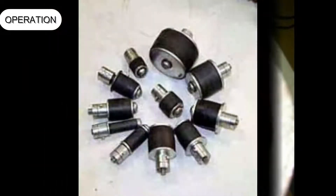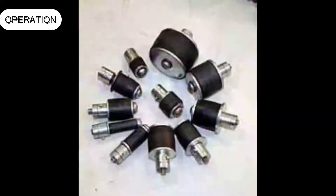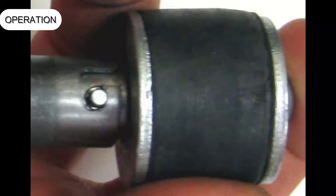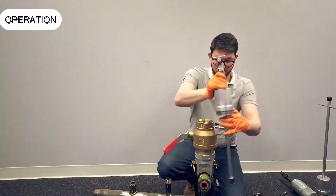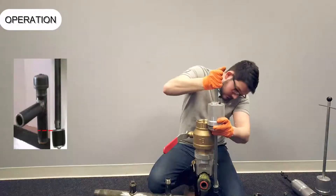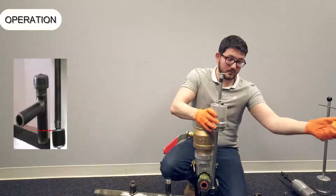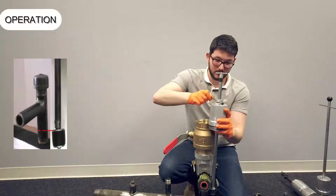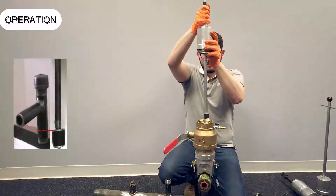If a self-tapping plug is not possible, a rubber expansion plug can be inserted below the branch. Choose the correct size expander plug and fasten it to the bayonet mount expander plug insertion removal assembly. Measure the travel needed to expand the expansion plug below the service branch by lining up the lip edge of the assembly with the lip edge of the ball valve. Push to extend the shaft so the bottom of the plug touches the main, then tighten the depth collar to reference your distance. Fully retract the shaft and fasten the assembly onto the ball valve.